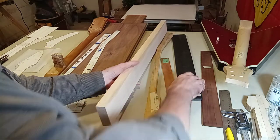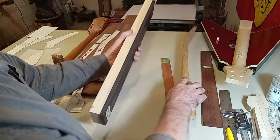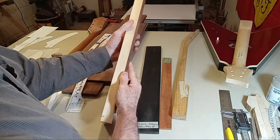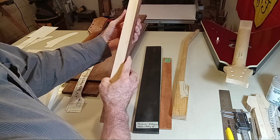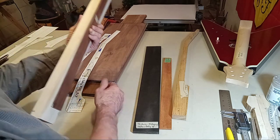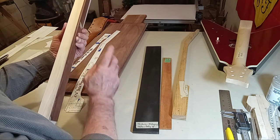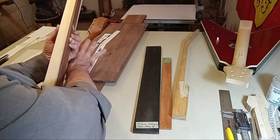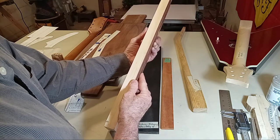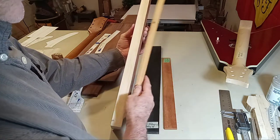And then whatever I put in the middle, whether it's rosewood, or I wouldn't put ebony, you're not going to do that. But typically what you're going to put as a center piece is something like rosewood. And rosewood is a beautiful wood. It's very stable, and that's probably why this is on the table. That's a Bolivian rosewood, for an acoustic or classical guitar set. I'll have some drop when I lay out the body, and then I'll cut out what I need to act as my center line. And so you'll have your center line, and then you'll have your other piece over here.